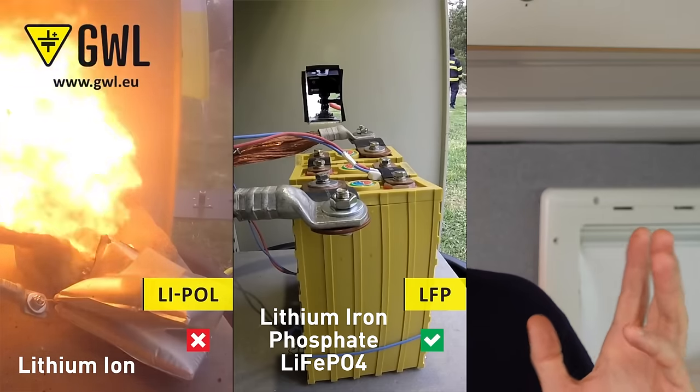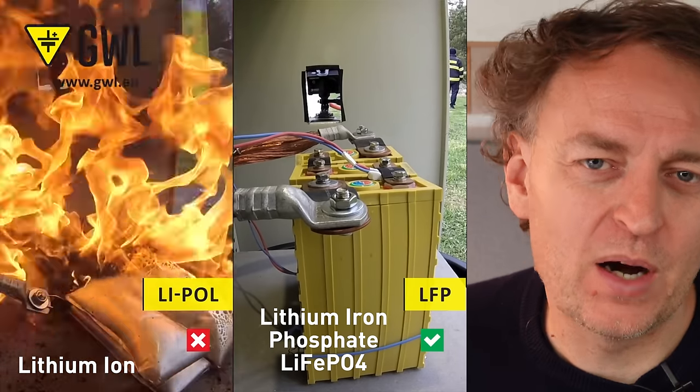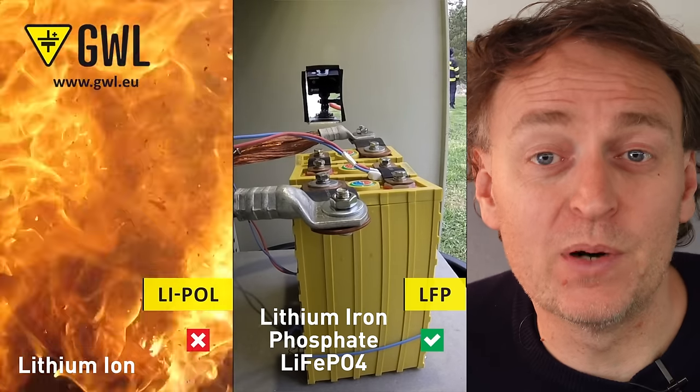This little video compares how lithium iron phosphate and lithium-ion battery packs swell and explode when short-circuited, and you can see how much more violent the explosions are for lithium-ion battery packs versus lithium iron phosphate. So for all your devices in the cockpit, be very careful about leaving them in the sun, don't let them get too hot, don't leave them charging for long periods, and if you're not going to use the device for a while, discharge it to around 50-60%. DJI actually have their drones drain to 50% automatically if you haven't used them in a few days.